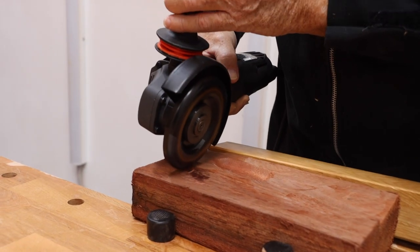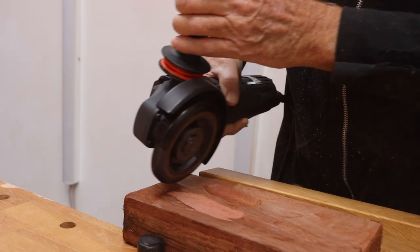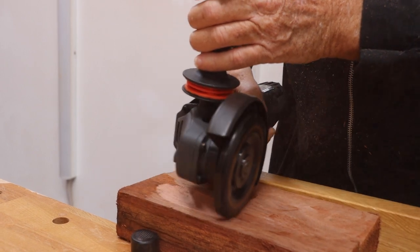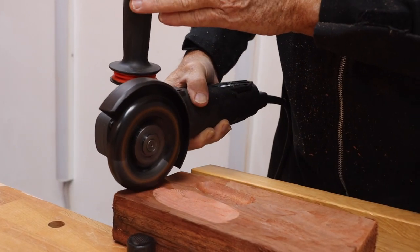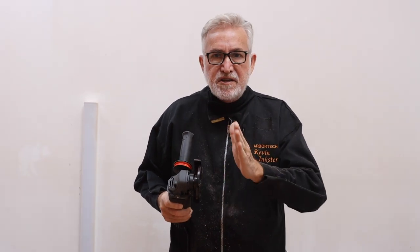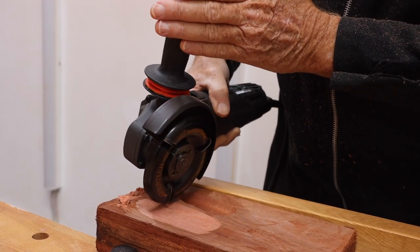So first of all vertical — no cutting. This cut is very useful if you're just wanting to take a very fine cut near the end of your project. You don't want to accidentally take too much material off. So if you lean it on its end and then just very slightly angle it, it'll take a very fine cut.